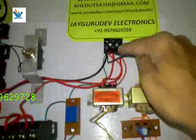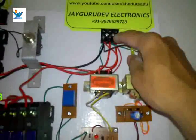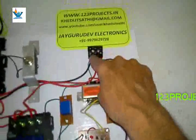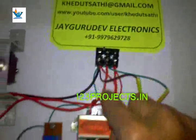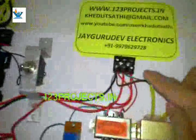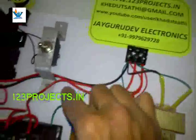This is the potential detector circuit. This circuit will detect the actual amount of power available at the third phase, which is converted from single phase. The first is the neutral phase directly from the supply, and the third is the generated phase — an imaginary phase created by the capacitors.